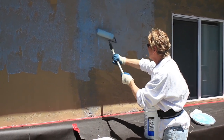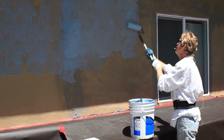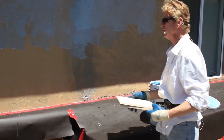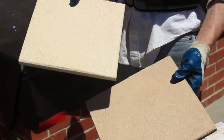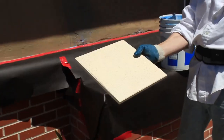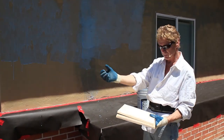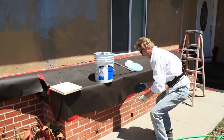I'll tell you another thing — we've been doing this a long time. When I first came over here I showed them the finishes. This is a 20-30 sand finish — they floated it then textured it. What we're going to give them is a 16-20 sand finish — we call it float finish because we use a float to pull the aggregate out and achieve the sand finish. That's what we're about to do.